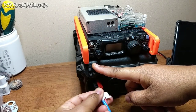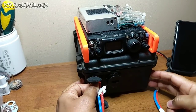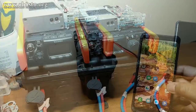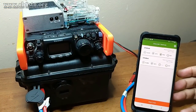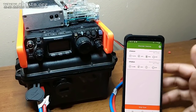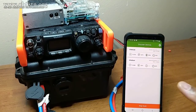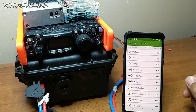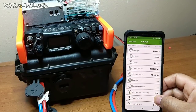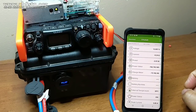This pack is normally used to power my Yaesu FT891, but it also makes an excellent grab and go pack for rapid deployment scenarios. This portable power supply is a sibling of the 45 amp hour solar generator we built on the channel earlier this year. It also has the Bluetooth shunt built in, as well as relays controlling the DC outputs on the front panel of the pack.